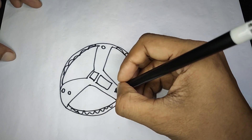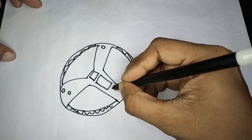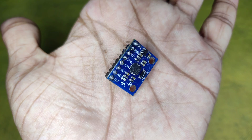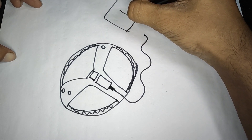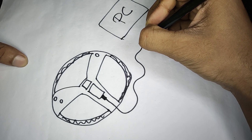This was my initial design. The controller will work just like your PC's keyboard — pressing forward, left, right, etc. We can use an Arduino Pro Micro for that. For the steering wheel vibe, I decided to use an MPU6050 IMU, or inertia measurement unit — I will just use one axis of data. And some buttons for pedals, brake, nitro, etc. Everything will get power from a single USB cable that connects to the PC, so no need to worry about powering — a win-win solution.